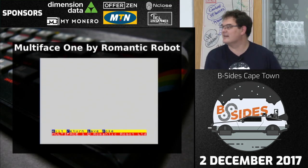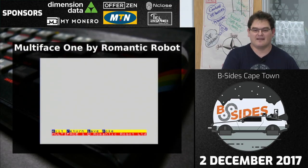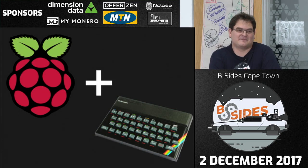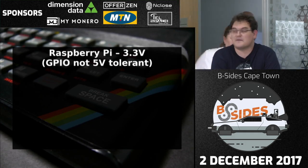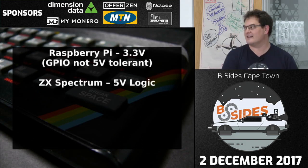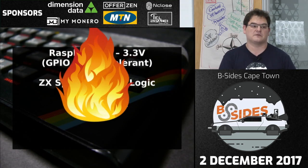So my plan was to take a Raspberry Pi and fasten it to the back of a ZX Spectrum. Unfortunately there are a few problems. The Raspberry Pi is a 3.3V device; the ZX Spectrum is 5V. The Raspberry Pi is not 5V tolerant — 5 is greater than 3.3, so boom. I thankfully didn't let the magic smoke out, but technically you'll damage your Raspberry Pi. You can fix this with a bi-directional level shifter using little FETs, and it does work.